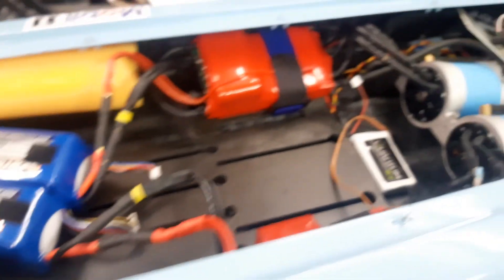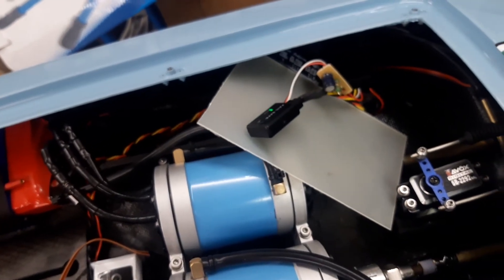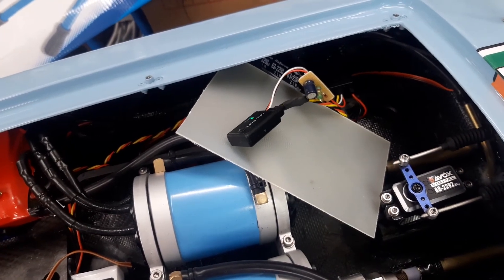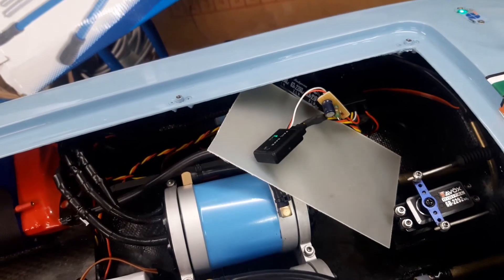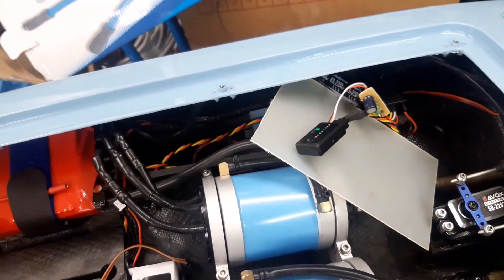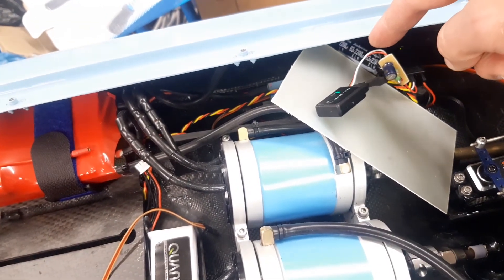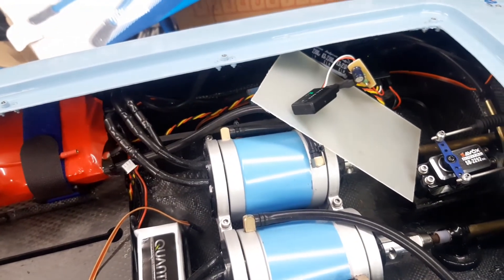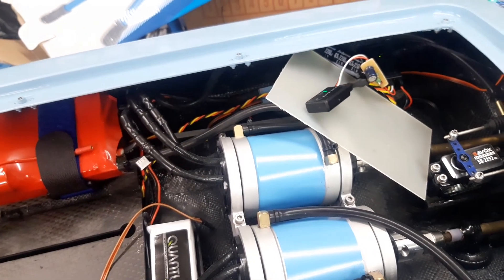What I modified is: I worked out that the power of the failsafe module is not cut off immediately. You see the small diode here, a small resistor and a capacitor. This test at first did not work, but with the big capacitor in behind — it's 2200 microfarad — I do have a change in cut off behavior. The hold time issue is now solved.